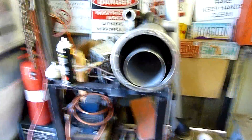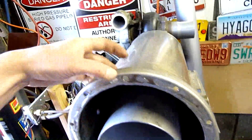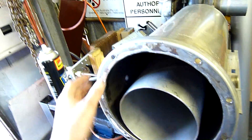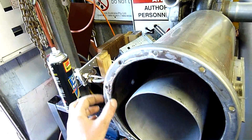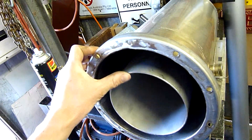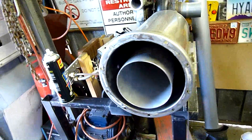G'day folks. I figured there's no easy way out of making flanges for this turbocharger jet. I really need a solid flange for this combustor tube. This thin sheet metal is not thick enough and it's not going to level out when I clamp it down — the whole thing's all over the place. So I'm going to make an annulus that goes around here and gets welded on inside and out. It's going to be 12mm thick, and I'm also going to make an outer combustor end plate, also out of 12mm steel plate.